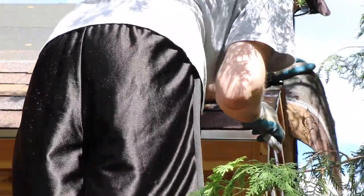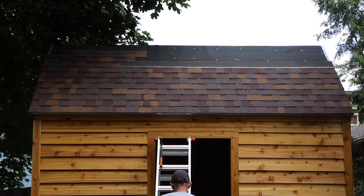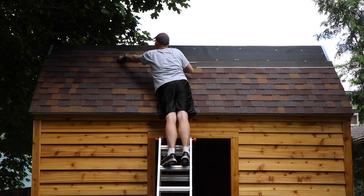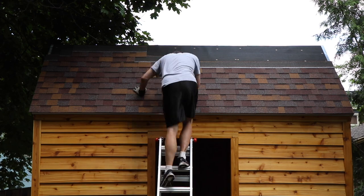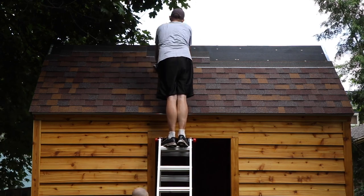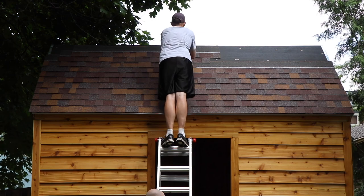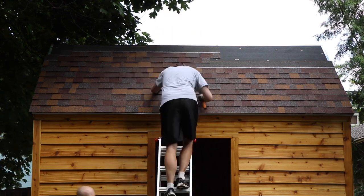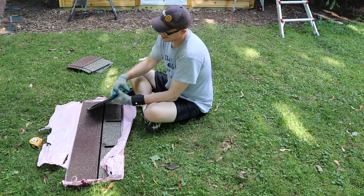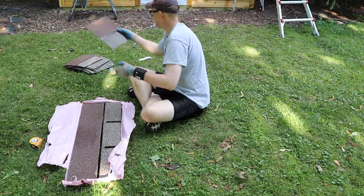If I were to do things again, here's what I'd do differently. First, I would get different lengths of drip edge. I was off my iCreatables.com downloadable blueprints — not a sponsor, I just really like their stuff, link in the description. My drip edge sections were 10 feet wide but the roof is 12 feet wide, so I had to figure out how to position it. It would have been great to get 12-foot-long material. I flashed it appropriately, but it would have been nicer to have the right length from the start.